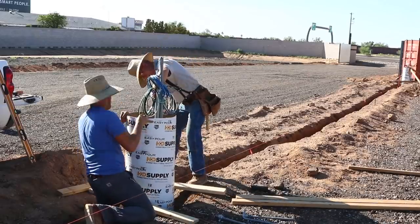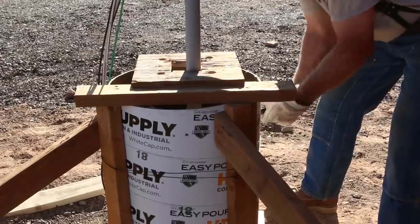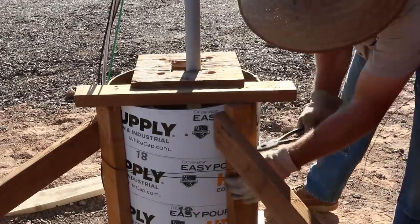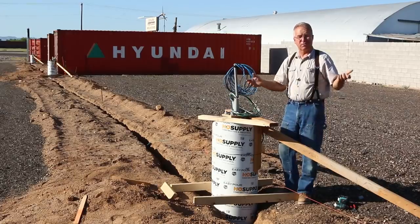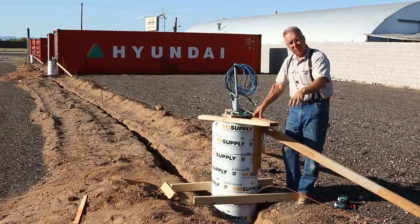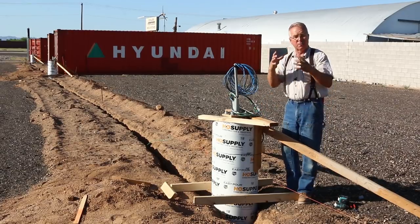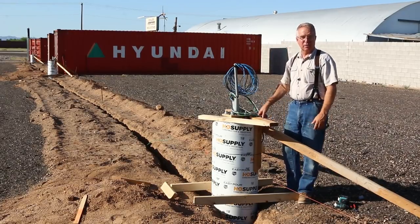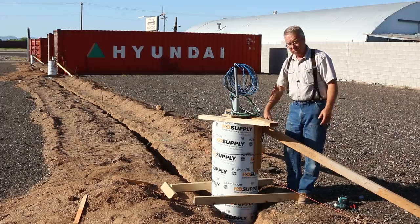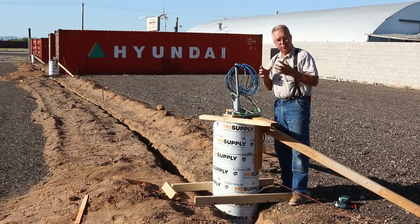You can cut them down and make little short piers. You can use them full length, which is ordinarily 10 feet, to pour columns in a patio or in a gazebo or in a sports stadium or for a pier that's going to be buried underground. It has to get down to a real solid bearing condition and comes up. And anywhere you need a concrete column and you don't want to build a square box, you can use a sonotube. So what these are going to be doing is holding up a street light.